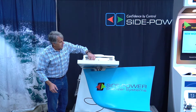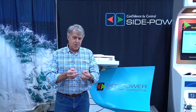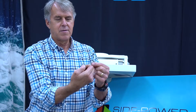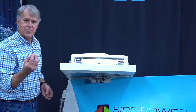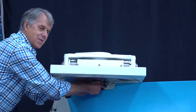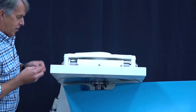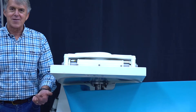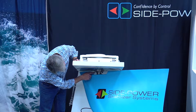While the fin is held up, somebody else takes a nut and two lock washers. These lock washers have a fine side and a coarse side — install them with the coarse sides together and the fine sides visible on the outside. Use new ones every time. Put them on any available stud. While those guys are holding the fin, just get two opposing nuts on — just a couple of threads. Now the guys can let go of the fin and you can take a more leisurely approach. The fin is now held on by those two nuts.